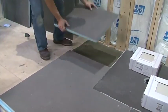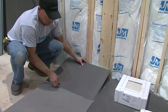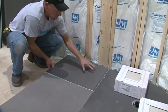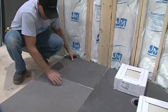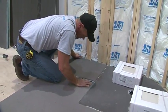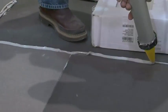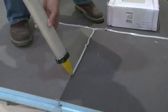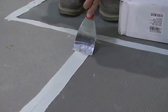Make sure that no thinset is in the area where sealant will be joining all the parts, because thinset in this area will allow moisture to wick through and leak. Finish these joints off by applying another top surface joint of sealant and putty knife flat. This step can be done after completion of assembly, as you might accidentally walk through the uncured sealant.